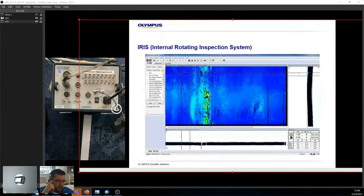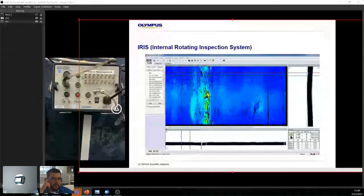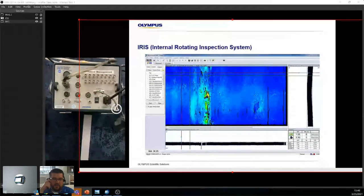So with the way that eddy current, remote field, near field, and MFL probes are made, they have a kind of pusher nose, right? So even if the tube is not 100% clean, when you're pushing that probe down the tube, because you gather data on the pull, since the pull is more stable, more constant, you're able to remove a lot of the junk and all that stuff.